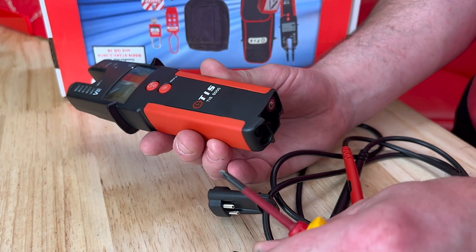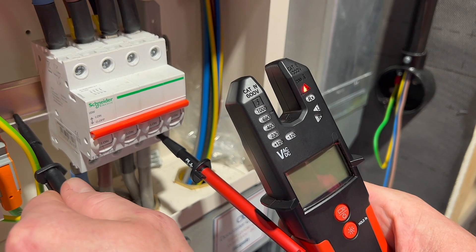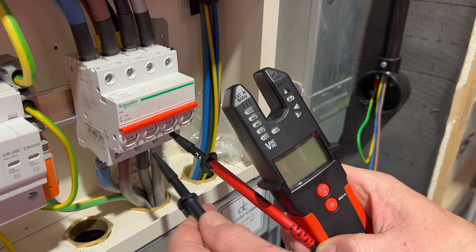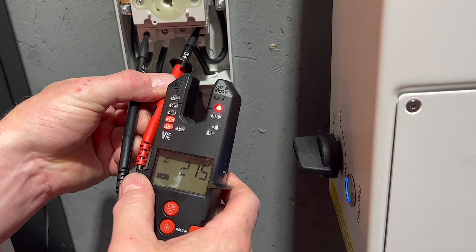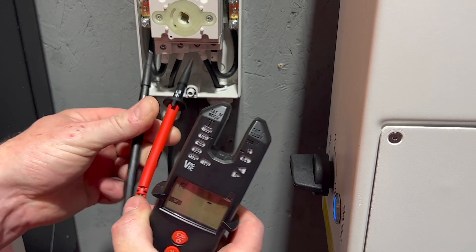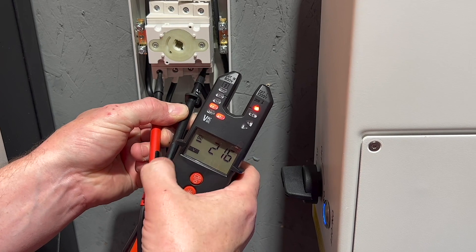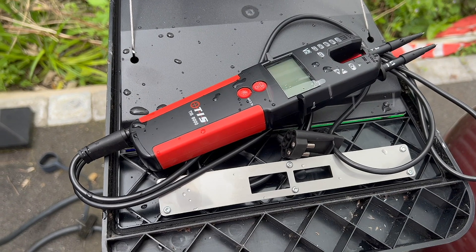To be an approved voltage indicator, it must still identify voltages with no batteries in the unit. The unit will measure voltages up to 1000 volts AC or 1500 volts DC. Let's not forget the importance of safe isolation on solar inverters when working on them — you can also use this to identify the polarity of the solar string cables.